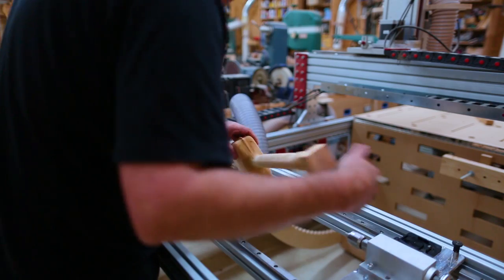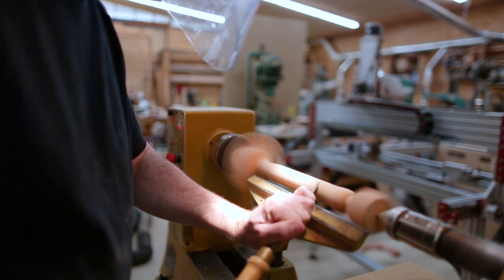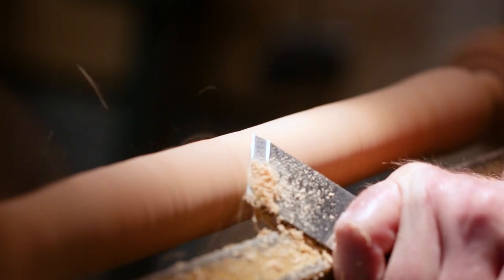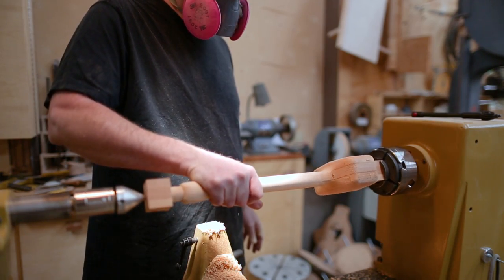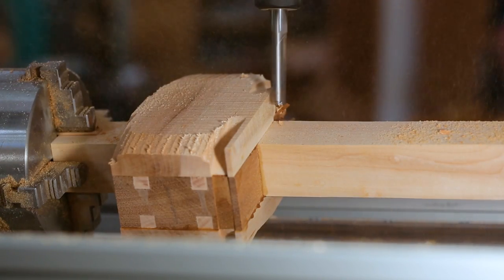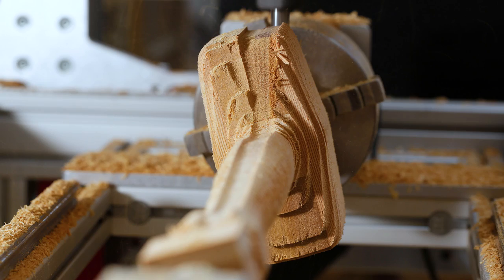On the first one I didn't like the way the handle came out — it was too fat. Rather than remaking the model, I threw it on the lathe and shaped the handle there with a skew chisel, which leaves a really nice surface even on splintery fir. On the later mallets I reworked the handle in the model — no finger bumps, a little thinner. On the second one I went too deep on the roughing pass, had to stop and back off a little, then did the finishing pass.